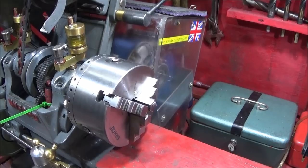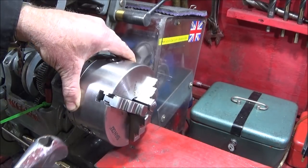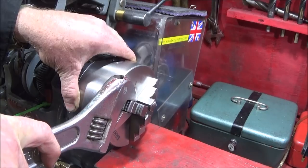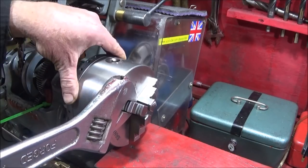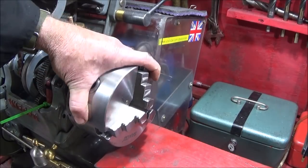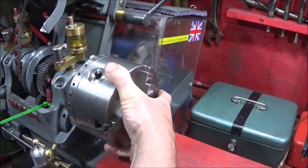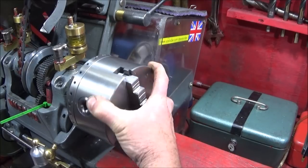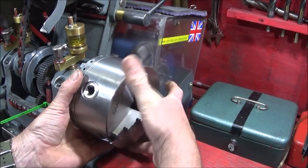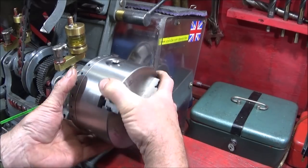I've been parting off with this lathe today. To hold the chuck in position, you hold it on the PVC, put a large adjustable spanner on the jaw there, and every time it will actually release the chuck. I've had no problem since at all in removing a chuck.